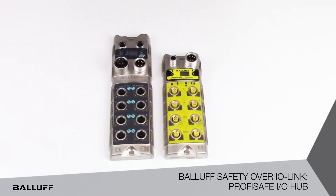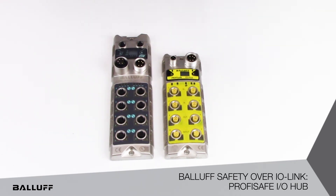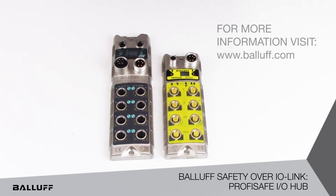If you take a closer look at the IO hub, there are four safety input channels. These are dual channel inputs, meaning each port has a 5-pole connector. Then there are two safety output channels, which eliminates the need for safety relays from the architecture. Each output is about two amps, so a total of around four amps can be fired through this safety hub. At the bottom, the last two ports are 8-pin ports to connect to devices such as gate switches with interlocking mechanisms.